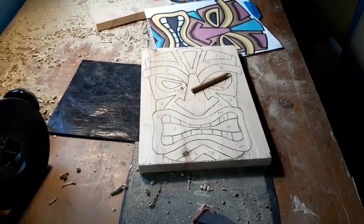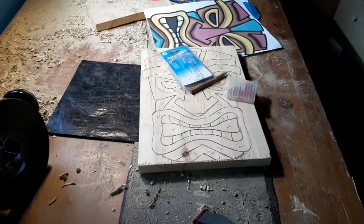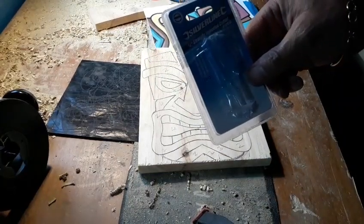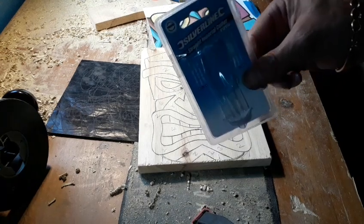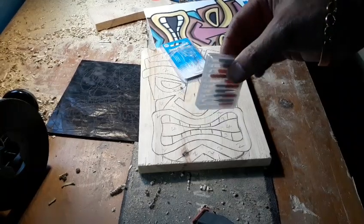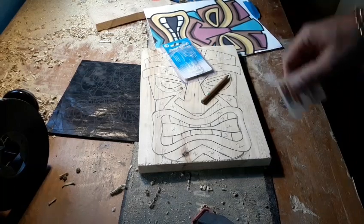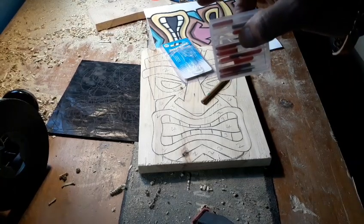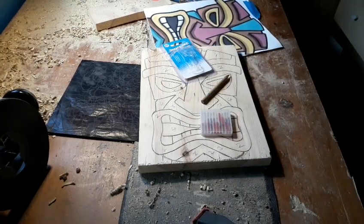The bits I'm going to use are just an imperial cutter — one-eighth by a half inch, big quarter-inch shaft — for my kind of router. And I like these little CNC bits; they're really cool and give a nice straight cut on smaller areas. You will want to get one with a quarter-inch shaft so it fits your router. So we're all set up, let's start routing out.